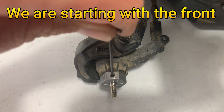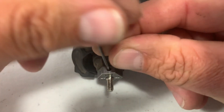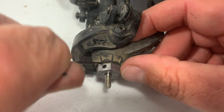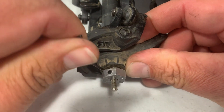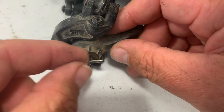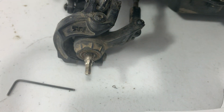The first thing I'm going to do is go ahead and get this set screw out and get this hex off. That's real easy — I think this is a 1mm. Go ahead and loosen that up. I just wedge it in the back here to try to help pop it off. We're going to go ahead and pop that off and then get the cross pin out. If it doesn't come out to where you can grab it, you might need a pair of pliers.